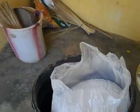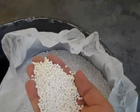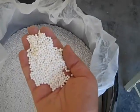The water has to remain in contact with the activated alumina for a certain amount of time, and the filter is designed for that. Each filter needs around 3 kgs of activated alumina of a particular grade. This is how the activated alumina looks.